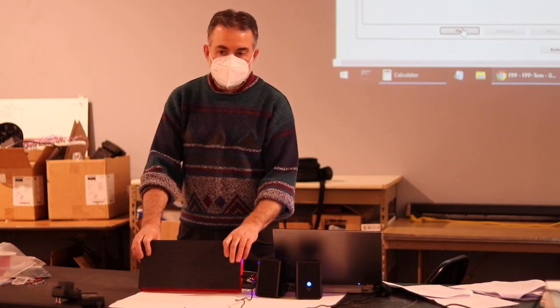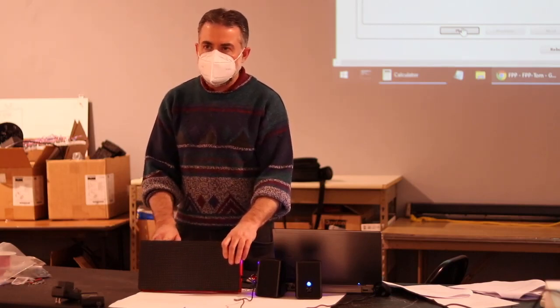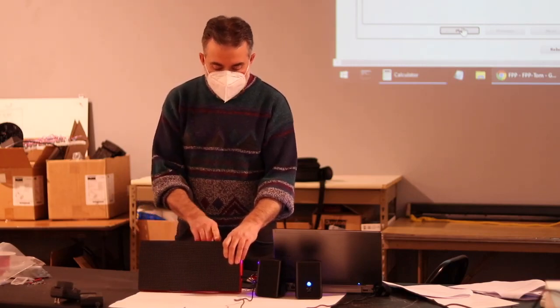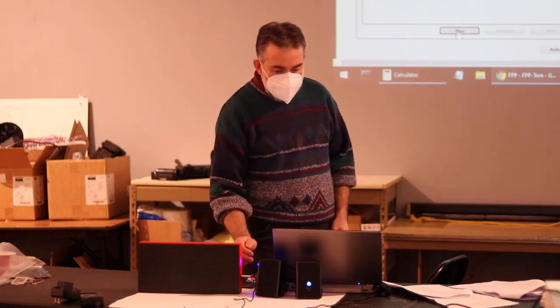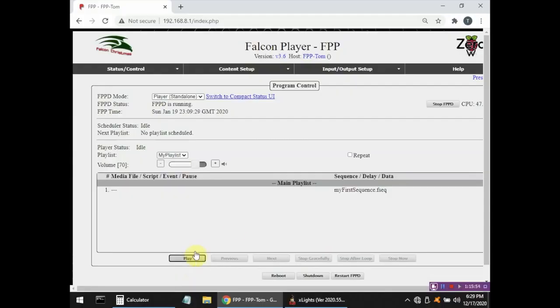Well, you notice in xLights, originally I created a new sequence that was 60 seconds long. But as I was adding animations, I only added 5 seconds per effect. And I think the text effect was like 20 seconds. So I only made about 40 seconds of animation. So when you hit play on Falcon Player, it only plays that animation and then stops. So it actually played through the animation, then didn't repeat. You can actually tell it to repeat though.